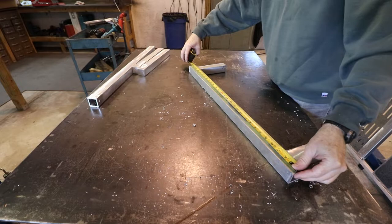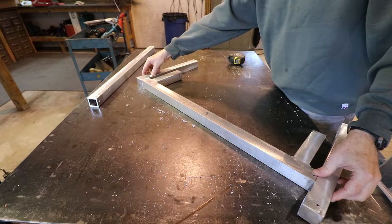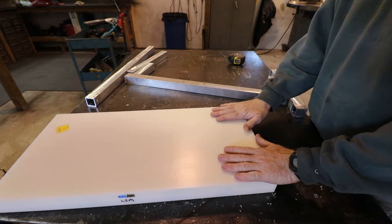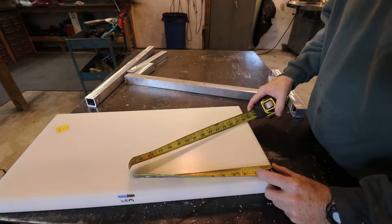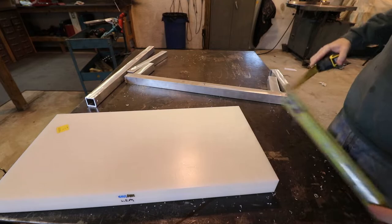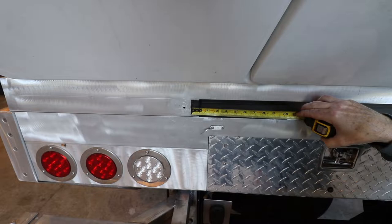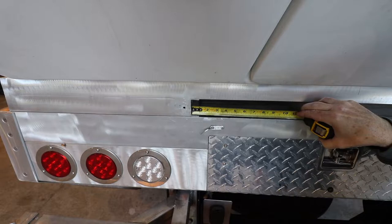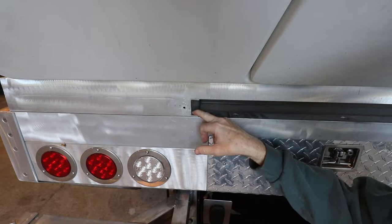The slot that's in the flatbed is 34 inches wide. These side pieces are an inch and a half. I'm thinking about making the Delrin - let's get the sheet and look at it. This sheet is an inch and three-quarters thick by 24 - boy, this stuff is heavy. So I was thinking about making the ends an inch thick, so I had plenty of space to bolt through and recess the bolts. Let's go look at the channel. The channel looks like about seven-eighths deep. I don't really want to put it real far out from there - the farther it gets away, the weaker it'll be. Let's just go with an inch. It should work perfect. That way if it gets too tight, I can always cut it down a little bit, or mill the back of the Delrin down to give me more space.